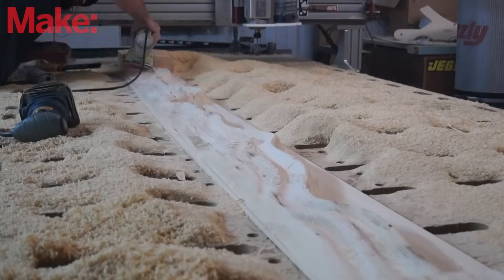Your job's done, it's cut — now comes the cleanup. You're going to have to take it out of the machine, and usually a CNC milled piece is going to have some things that need cleaning up. Sure, especially when you get into machining metal, sometimes you pull it out and it's just beautiful and done. But generally speaking, especially with wood, you're going to have to do a little bit of sanding to get rid of the marks the tool leaves behind. Or for woodworking joinery you may need to go in with a chisel. Even on metal machines you'll often want to deburr and maybe throw it into a sandblasting medium or a vibrating polisher. Generally, you're not pulling completely finished parts off of a CNC machine.